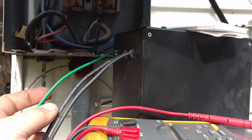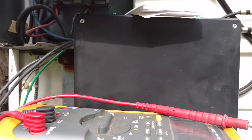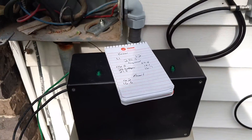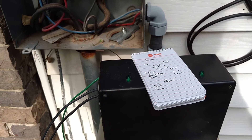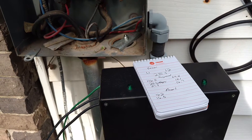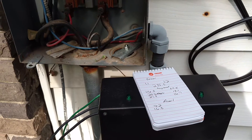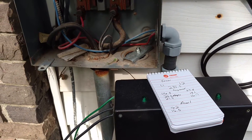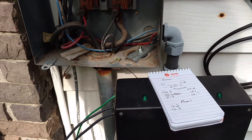This is where the wires tie into the box. I'll make another video on what it looks like on the inside of that. But basically, those are two little green lights that light up when you turn it on. It has two banks, and each bank has two 30 microfarad capacitors. They're wired so that the two 30s equals a 60, so you basically have 60 microfarads per side.